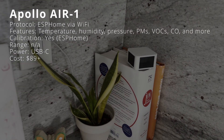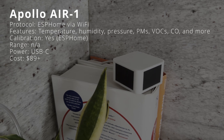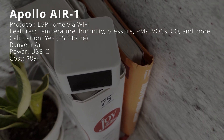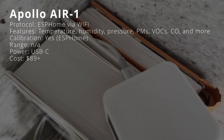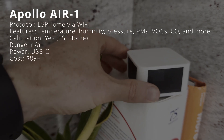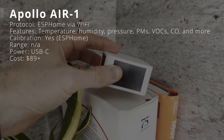The Apollo Automation Air 1 is an indoor air quality sensor that connects to Home Assistant locally using Wi-Fi over ESPHome. In addition to temperature, it can track humidity, barometric pressure, particulate matter, volatile organic compounds, carbon monoxide, and other gases. You can configure a temperature offset in Home Assistant. Note that the Air 1 uses a different type of temperature sensor than the MSR2 and MTR1. It is meant for indoor use, powered by a USB-C cable, and costs $89 to $149 depending on optional CO2 and gas sensors.